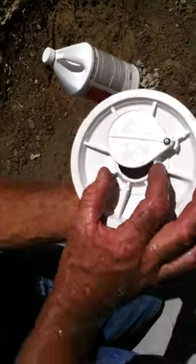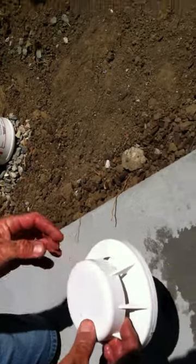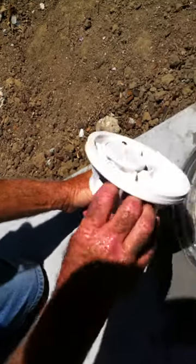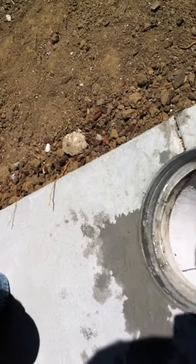You don't want to run the pump dry because it'll burn the seal out. So we usually run this about halfway or a third — you just look and see how much circulation you want. You just want enough to pull from the top, because if this is all the way open you're not going to get any suction from the bottom.